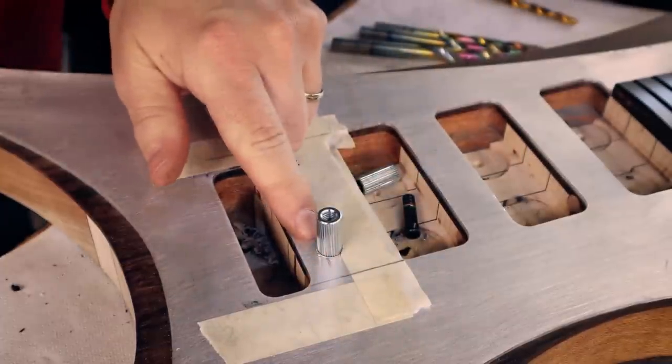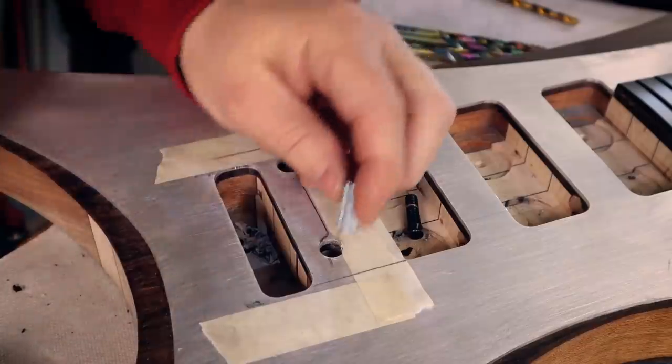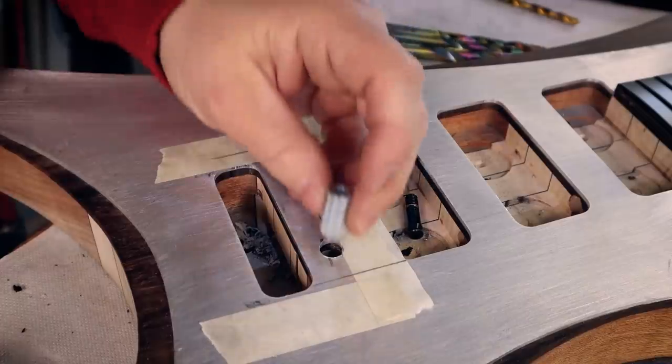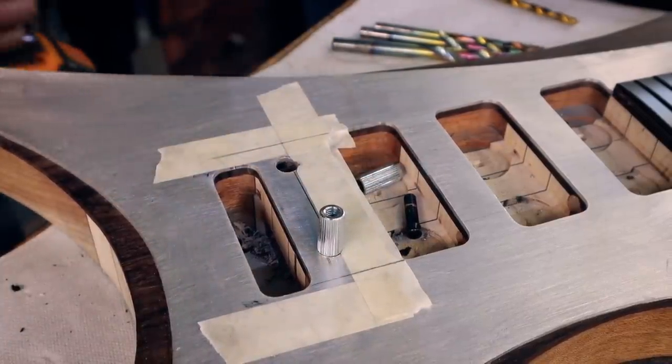Now, just to stop any potential deformation around the aluminium here, which is going to be visible, I want to drill that out to 10.5. Except I don't have a 10.5 millimeter drill bit in this workshop. Poop. There we go. Let's cool the whole thing off.